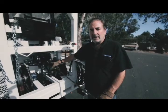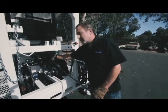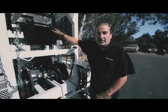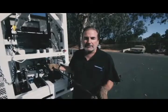To connect the mainline cable, run it from the top of the spool, over this sheave, over the top of the walking beam, and to the main top sheave pulley. Pull about 60 feet of cable off the spool.